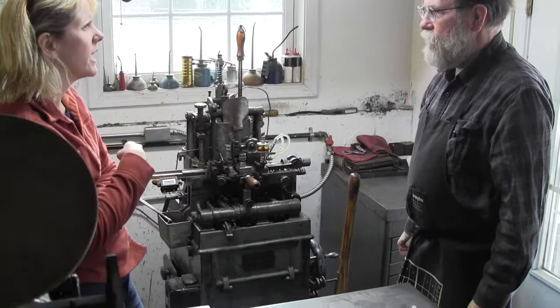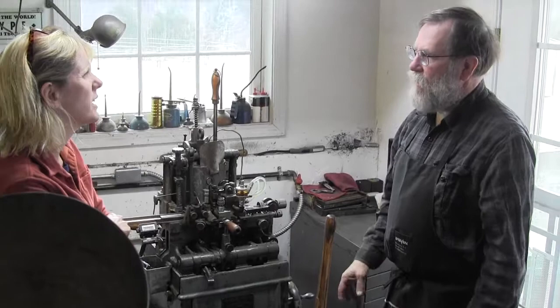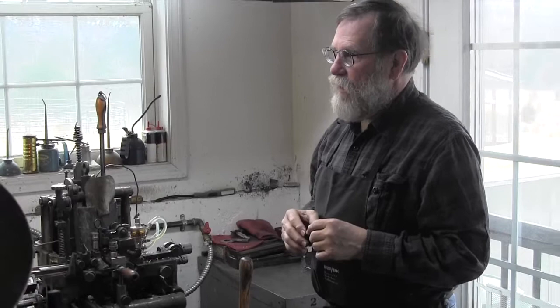At the heyday of those inland and central type foundries. Well, yeah, but they weren't using this. They were using either Barth casters or Bruce casters. It was a little different machine than this, but bigger, a slightly bigger scale. Yeah. Well, the Barth casters are very large machines with lots of bulk in them to use very high pressures, and they were also one size each, so you had to have a Barth for every size of type that you cast. Oh, whereas this one, nothing to trade out.